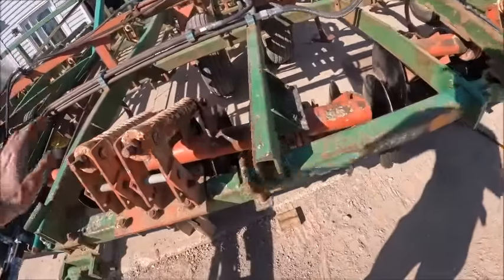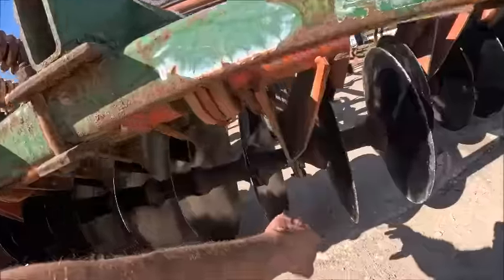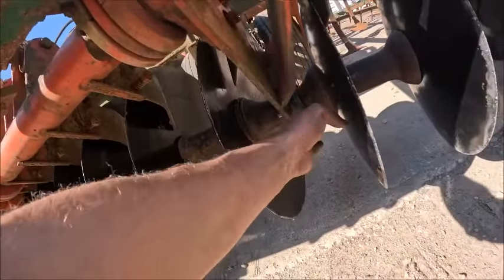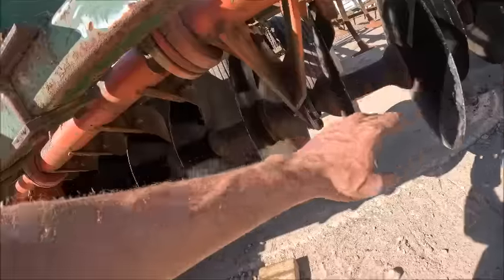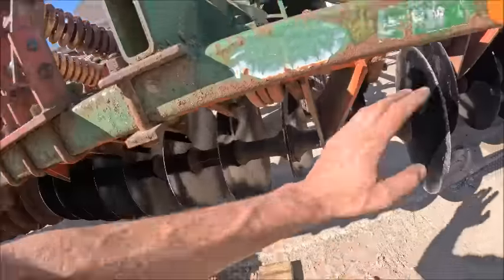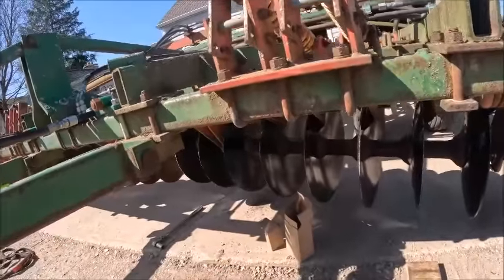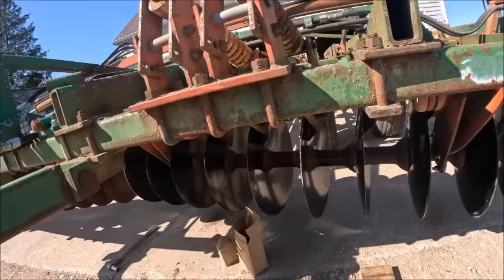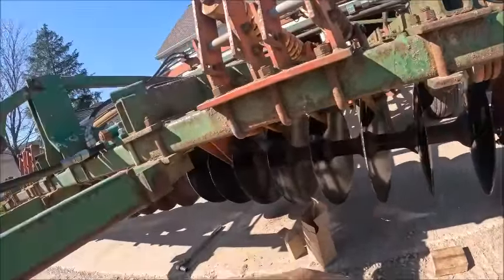So we just didn't. I actually had this thing on there twice because I had ended up having to put these cutoff disc blades back behind that spacer to move this bearing out. So apparently between all the spools on this gang, there must be roughly 3/4 of an inch worn off amongst all those spools, because apparently it ran loose at some point. So you buy new spools or you make a spacer and it works perfectly fine. So we just made a spacer.